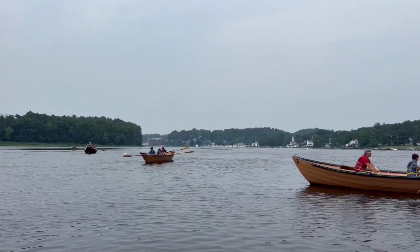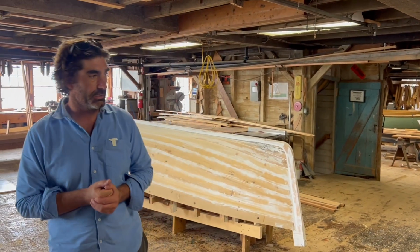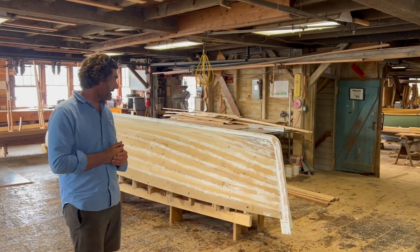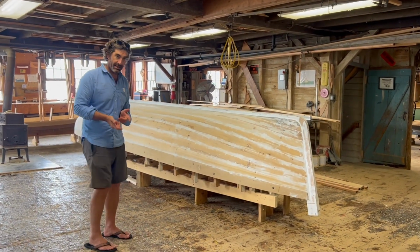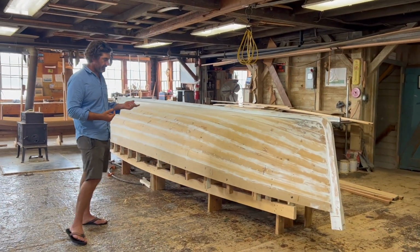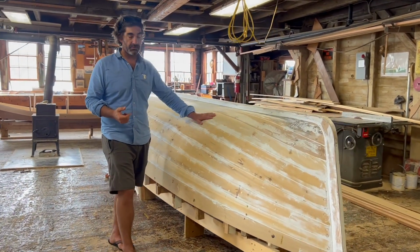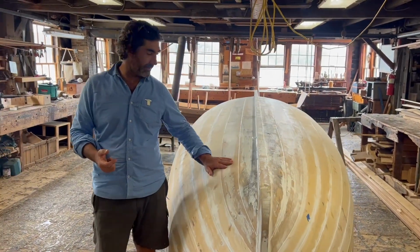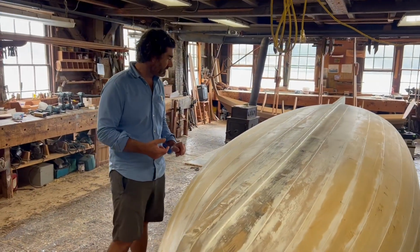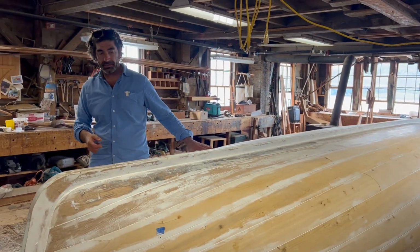So if you watch our last update, you'll see quite a bit has changed. We got rid of some boats, and we've got this one here. It was probably upside down last time, but it's been right side up for the planking to be finished. And now we've turned it back upside down so that we could fair the hull, which is a back-breaking affair that John can take most of the credit for. And then we caulked it, and then we puttied it.